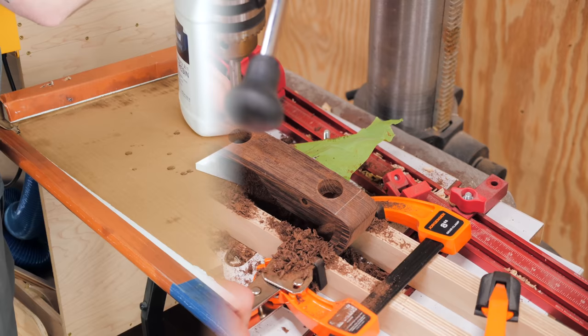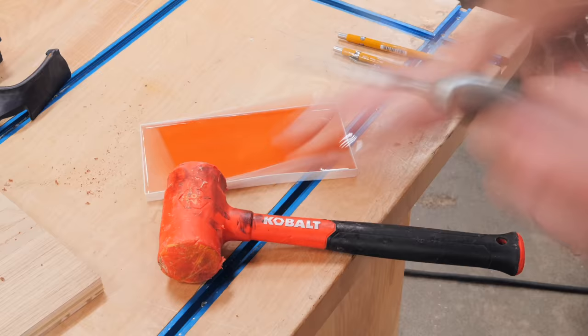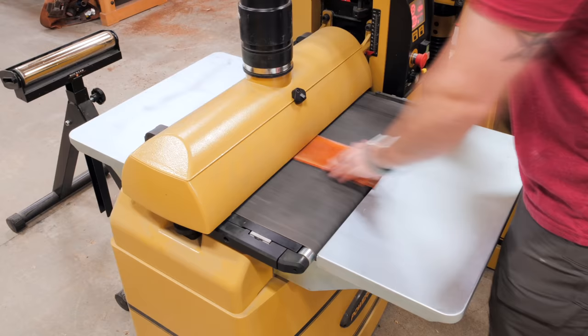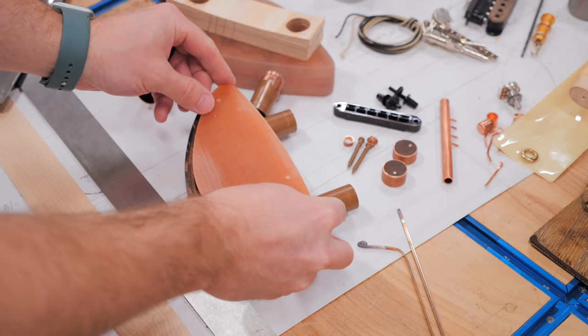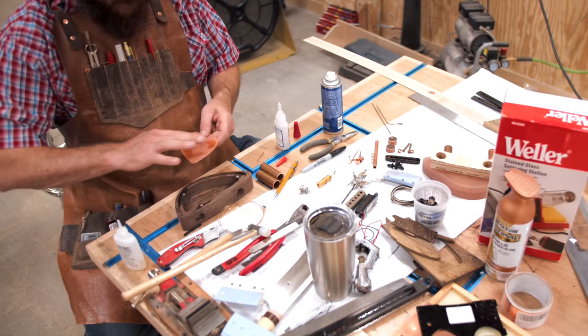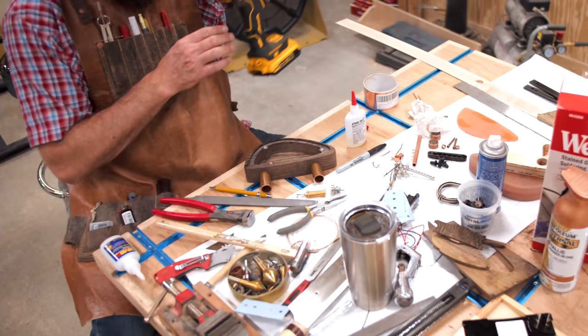For the control cavity cover plate, I decided to continue with the copper epoxy theme, and I 3D printed another mold, and then poured a thin layer of high performance epoxy and let it cure overnight. Unfortunately, this was still a little bit too thick for this epoxy, and the piece warped a little bit due to heat, but I was able to sand it down at the drum sander, and still ended up with the piece thick enough for the cover plate. I cut the shape of the plate as well as a few holes for magnets at the CNC, and after confirming the fit, Grant glued the magnets into the wing as well as the cover plate. He also went ahead and permanently installed the copper pipe into the wing using some CA glue, and then pinned the pipe in place with more Romex wire. Finally, he drilled a hole for the output jack, which will also live in this wing.